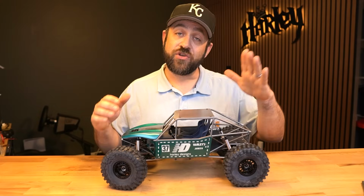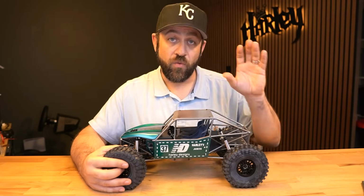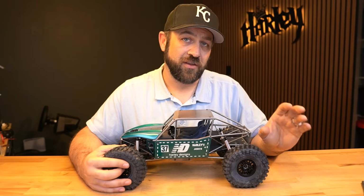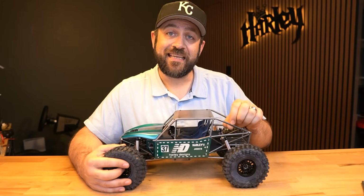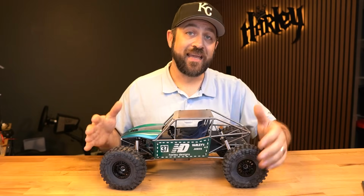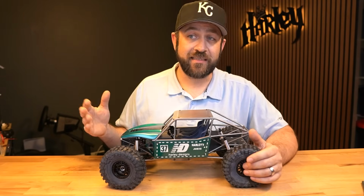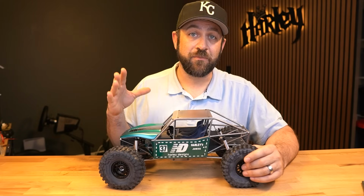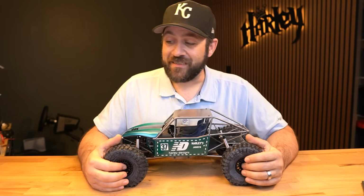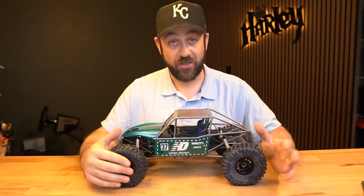You're going to need some M3 and M2.5 taps. I've found some spiral taps on Amazon that I really like, and those are the ones that I would suggest for that. The tubing itself I get from Stock Car Steel, and I'll put a link to exactly what material you should get from them. It is DOM tubing, but it's under the hydraulic tubing on their website, and it's 3/16 inch diameter and 0.035 inch wall thickness. I get it cut to 3 foot lengths, so you will have to select how long you want each stick. 3 foot lengths is just a very easy, manageable length, and it keeps shipping costs pretty reasonable also. You're going to need a bunch of zip ties. Small, like 4-inch narrow zip ties work best. Just get a big bag, you're going to use them.